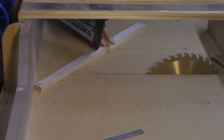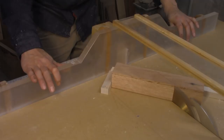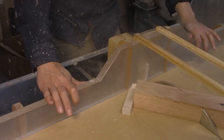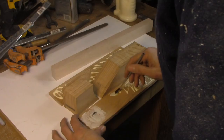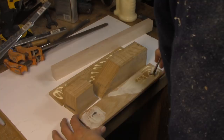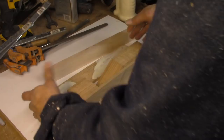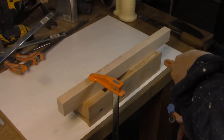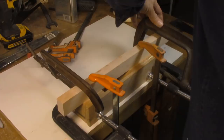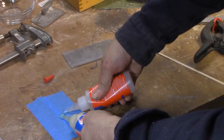I'm going with a beveled-down design, because that way your bed angle equals your cutting angle. When you go bevel up, you typically have a very thin bed which can be fragile. This arrangement gives me a thicker, more robust and stable bed. After cutting, I glued it up. I'm going through these steps quickly, but if you're interested in more detail about home plane making, check out my three-part series on making easy smoothing planes. One tip: use a lot of clamps — really, a ton of clamps.